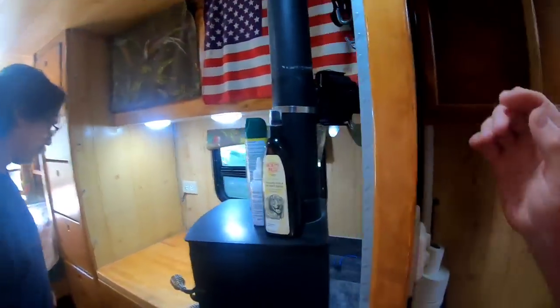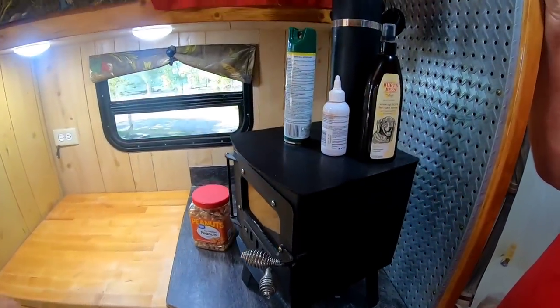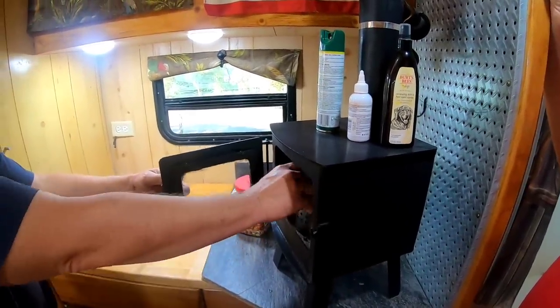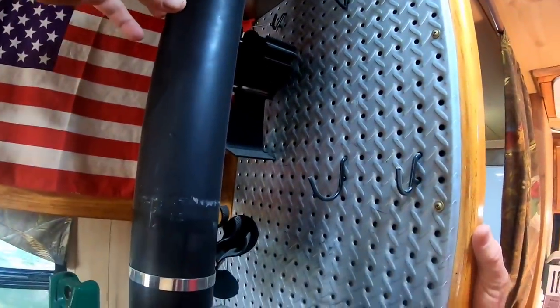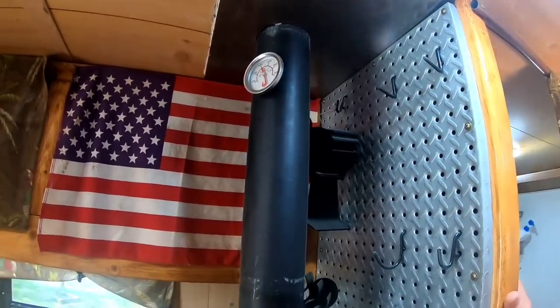We've got our mini wood stove here. It works great. I actually burn pellets rather than wood - I use a little metal canister and fill it with pellets, and that'll burn for an hour and a half per fill and puts out a nice even mild heat. If you burn wood it burns really hot - it'll almost cook you out. But this is all designed with fire brick and a fire plate. None of this ever gets hot, and the chimney flue can get up to 450 degrees but the roof has never gotten hot. And again, a cargo trailer has a metal roof - there's no vinyl or wood up there, so you're pretty safe.